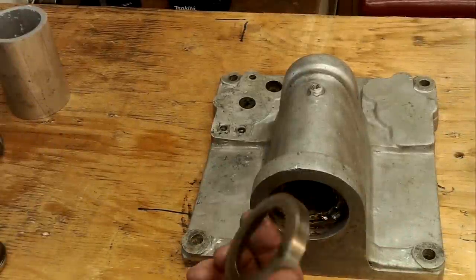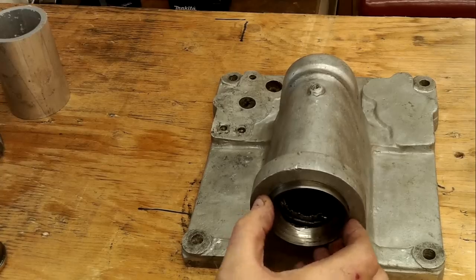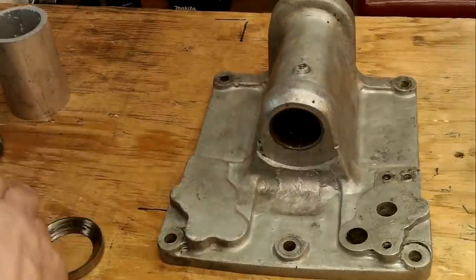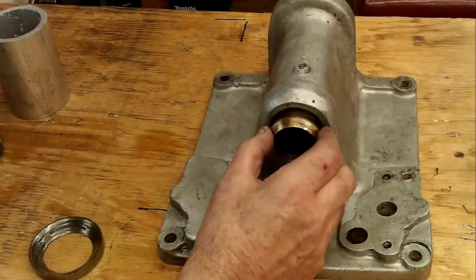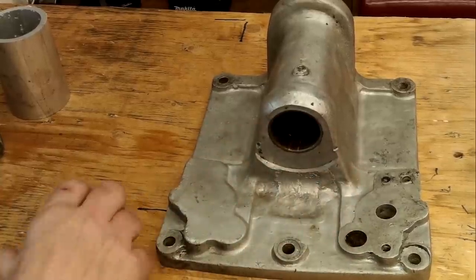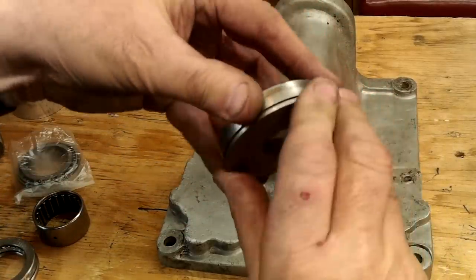My choice of bearings is for the following reasons. The bottom bearing used to be a greased friction cone and cup device. The top bearing is a similar system. These have to be regularly greased and adjusted. Even then, under load they were very hard to turn. As for maintaining a straight line along the roadway without having to constantly nudge the steering — that's at best tiring.